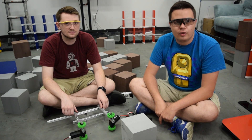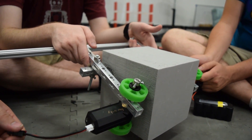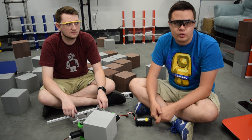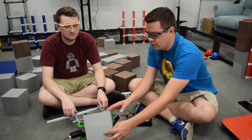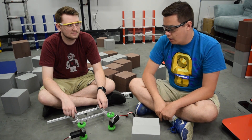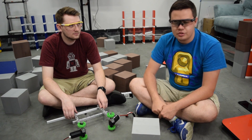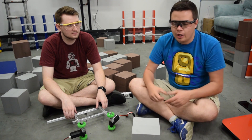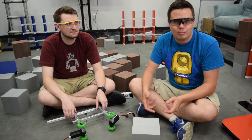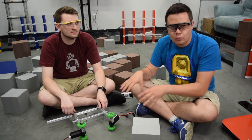It sort of works. If you get the glyph perfectly aligned with the rollers, it works pretty well, but it doesn't really deal with a glyph at 45 degrees because of the small fixed rollers, or a glyph standing at a near-impossible angle. When you get it aligned, it works really well and grabs a good hold of it, but we need to do some refinement. It holds a glyph, but you can't really get a robot to pick it up — it's kind of a mechanism in a box that only works by itself.